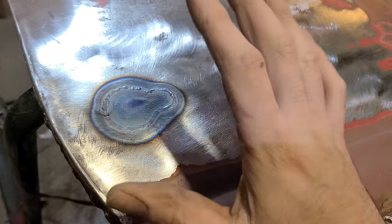There's just the sheer extent of the modifications that are going to be going into this door. We could do it with the skin on, but it's not going to turn out better that way. It's going to end up being more work in the long run trying to work around it, because we are going to have to section through here on the inner panel. I can't just chop the bottom off to section it. I have to go through here because of the way the bottom of the door is shaped and fits into the cab. It is going to have to be cut through here.